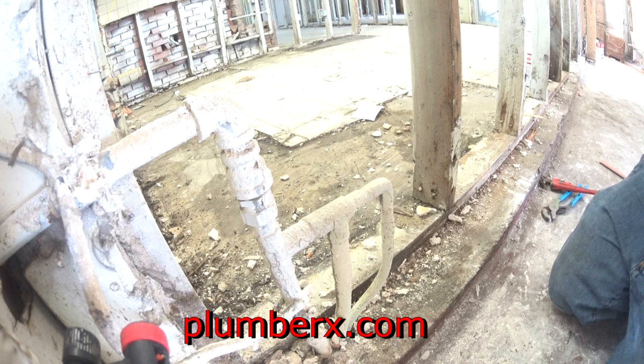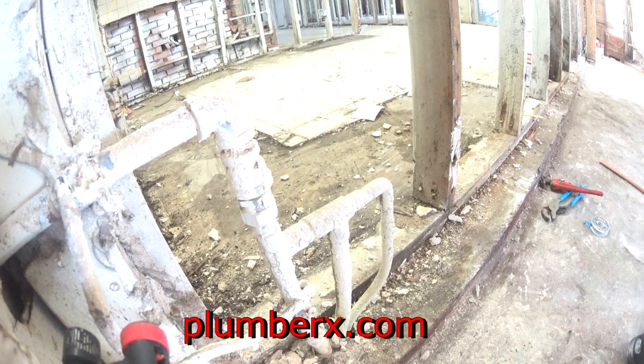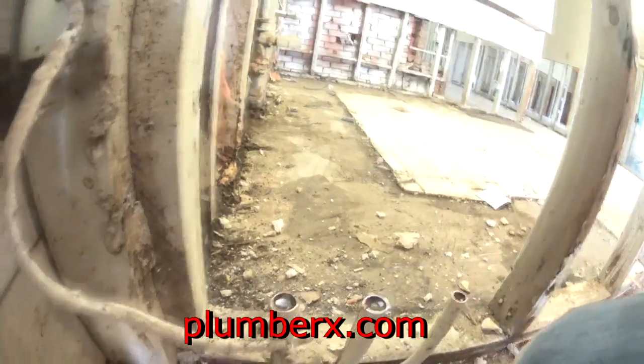That's going to the outside faucet, and the three below, which is two 3/4 inch pipes and a half inch. One of those 3/4 inch is the main coming into the house, where we're going to put a new ball valve on it so that they will have a cutoff here. And the other two will go and service the other parts of the house, the two bathrooms in the back, the hot water heater, etc.